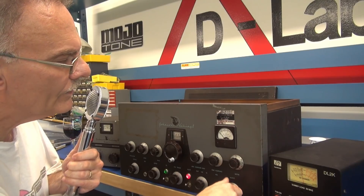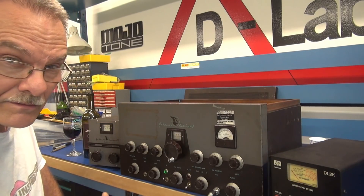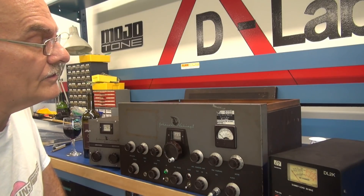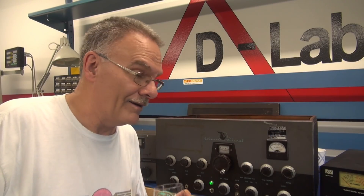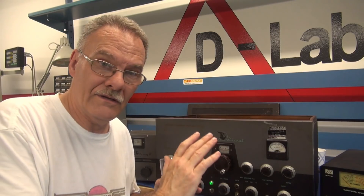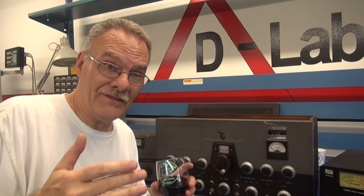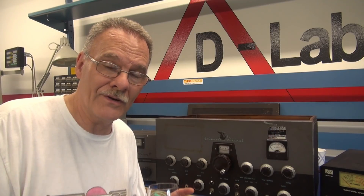No audio either, so I'm assuming there's probably an issue in the modulation section. The good news is it fired up with no smoke and we got 100 watts output — so this one is definitely saveable, and you don't have to call the number on that funeral home tag. I need to address the modulation problem and push-to-talk next, which will be in part two. This video was just to show you an easy, safe way to initially power up and test your Johnson Viking 2 transmitter. See you in part two.